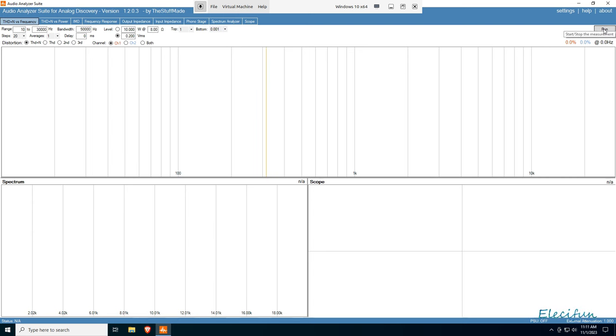0.064%. And as we get into the realms of, let's say, 150 watts, 0.05%. And as we do our crossover to 1% distortion, let's just put that right on the peak there, 179.29 watts. And if we just take this from the 0.1% on the crossover there, we're at 172.284 watts at 0.109% distortion. That's pretty darn good.